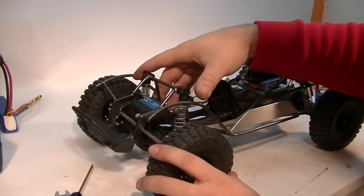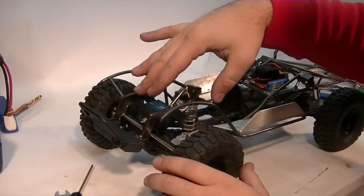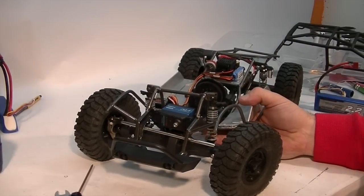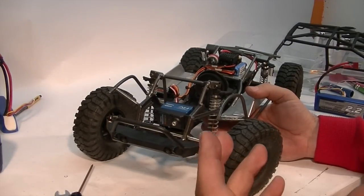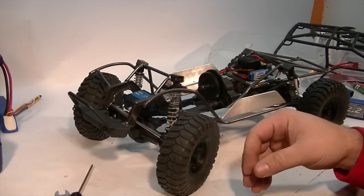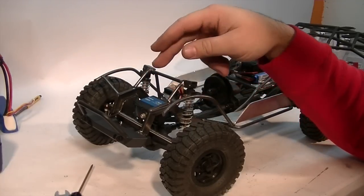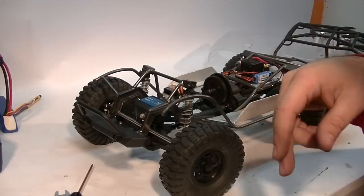For steering I've got the BLS-157 HV. That's a lot of servo for a 1.9, but I do like the speed and power it has so I pretty much use it in everything I can. It's 520 ounce-inches of power at 7.2 volts. I always go with high-volt servos and as much power as I can get in a standard-size case. That servo is actually discontinued now and they have the 177 HV as a replacement, which adds S.Bus.